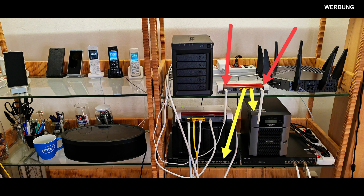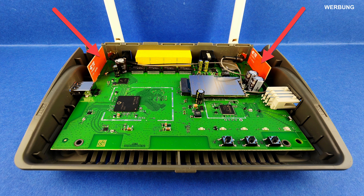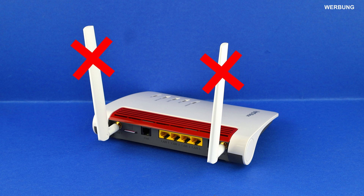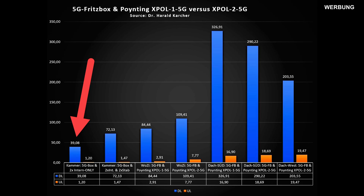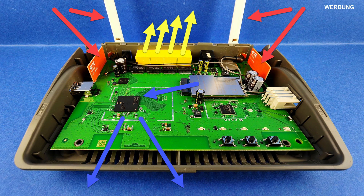Let's start in the technology chamber, which is hostile to wireless. For the first round of measurements, we unscrew the wide LTE antennas of the router. The mobile network then only enters the 5G router via the two red antenna plates. With this slightly amputated Fritzbox, we get a reasonable download of 39 Megabits, but a very weak upload of 1.2 Megabit. The numbers show the final average of several individual measurements. In the second measurement, we pull the mobile internet into the 5G box via all four antennas — what the four red arrows symbolize.